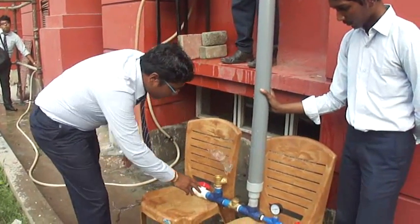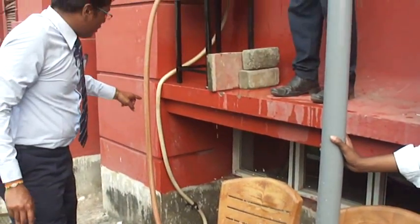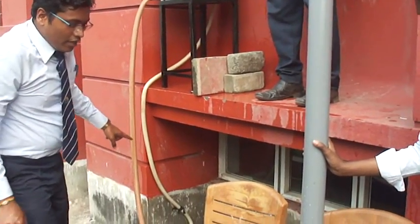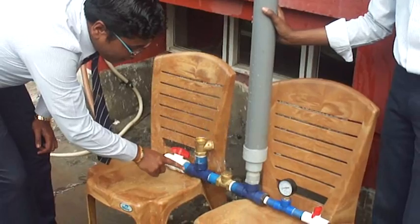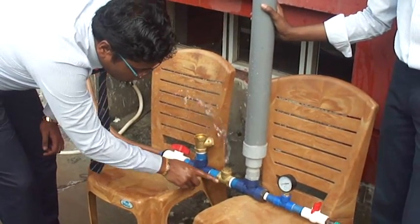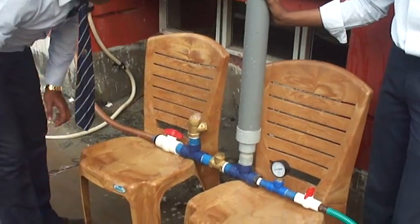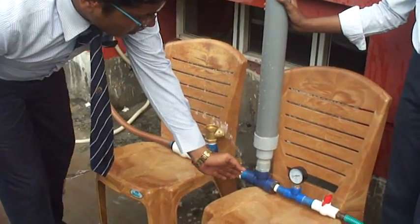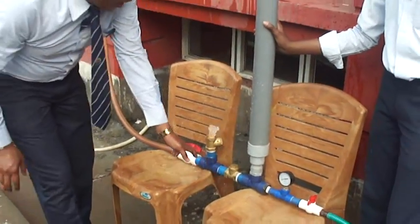This pressure energy goes through the T-junction in two directions. There is pressure in one direction, and there is also pressure which goes in the other direction, pushing the water through — because this is a one-way check valve. Whatever water comes in goes in that direction and cannot come back, because it is a non-return valve.